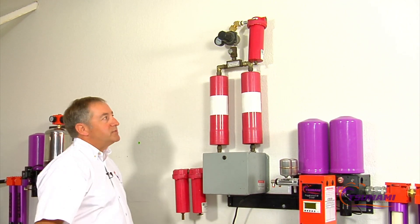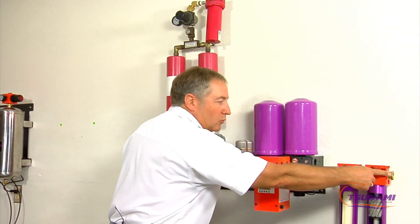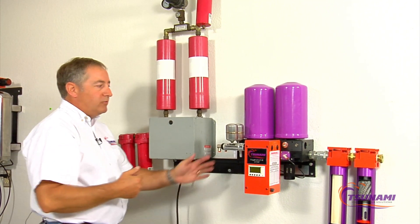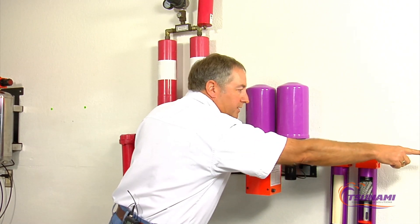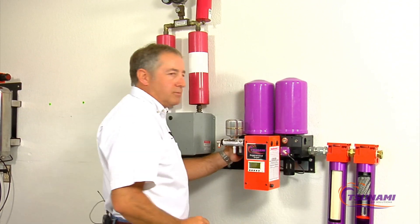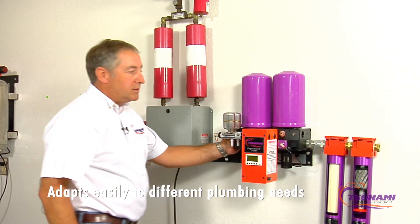Some of the main differences in designs are the plumbing. We come in from one direction — we have an inlet, come through the dryer, and can come out the outlet continuing in a straight direction. If you need to re-plumb it and go in that same direction, you can very easily plumb in piping from this direction, coming out one of these outlet ports and going right out the same direction, or put an elbow and go up or down as needed. So it's very easy to plumb.